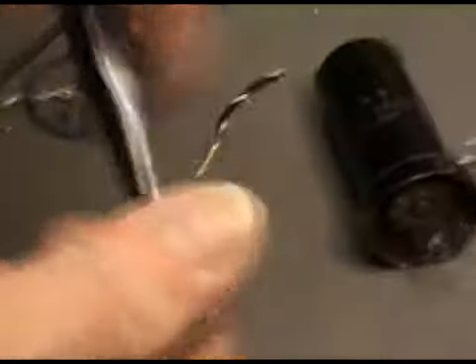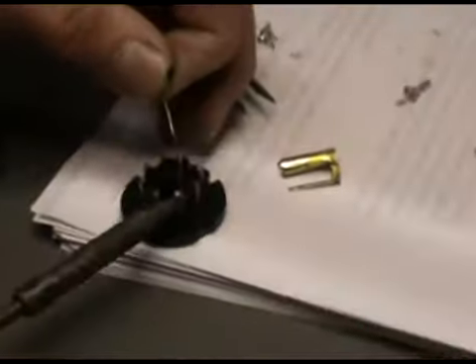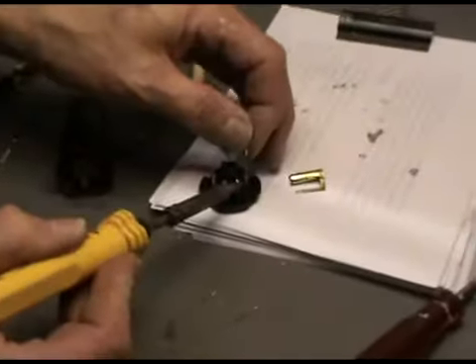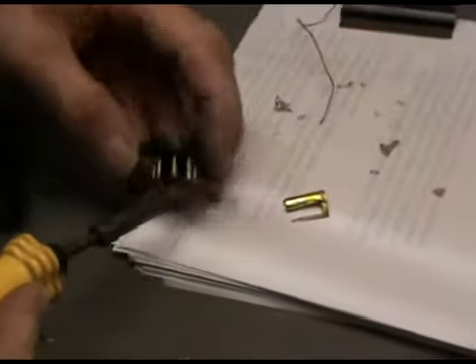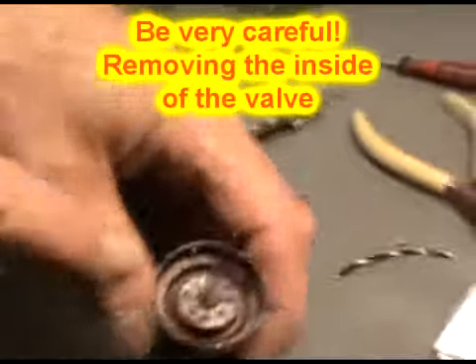The first thing you do is take this bit of metal out because we don't want it in the way — it's soldered in here. It's proven a bit obstinate but it comes out. The base is now clear. At this point you need to get the solder out of all the holes, put fresh solder back, heat it, tap it out, and the hole will be nice and clear. There we go — it's now clear.